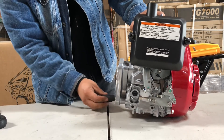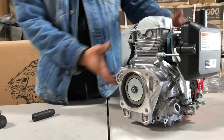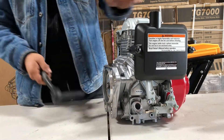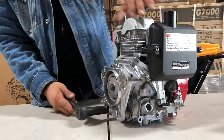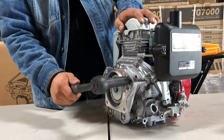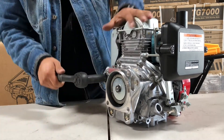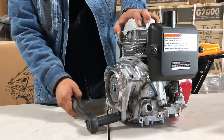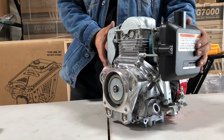This shouldn't be a common change on a rammer, but it's something to consider, especially if your engine's working really well but the rammer is just not jumping. This is kind of the first thing I would check — pull the engine off the rammer and make sure that the actual clutch is not torn apart and all the springs on the inside are connected. We're just tightening, doing a cross pattern instead of clockwise — doing opposite pointers for that tightening method. And that is it. Thanks for watching.